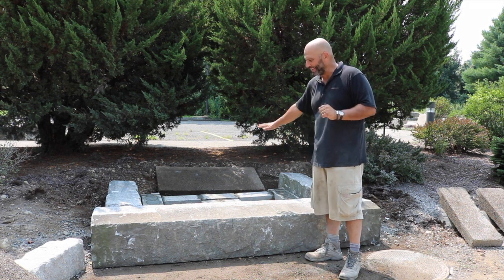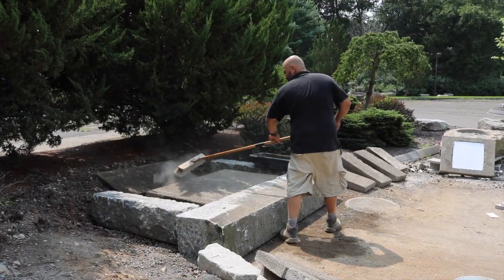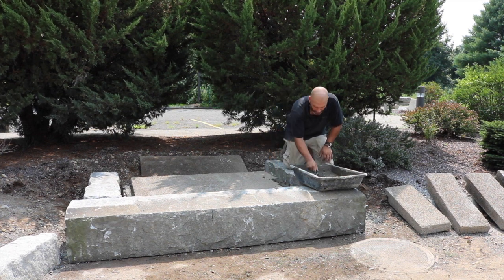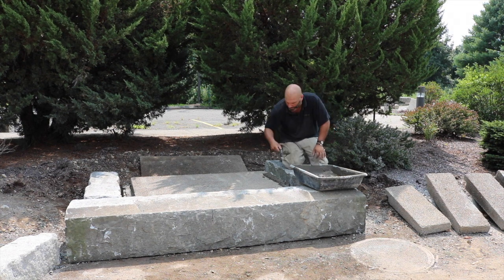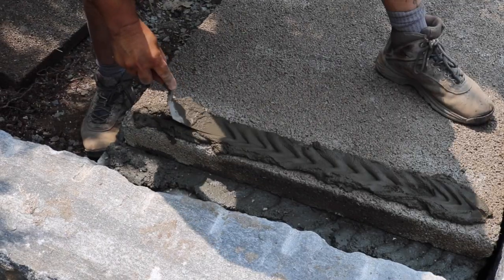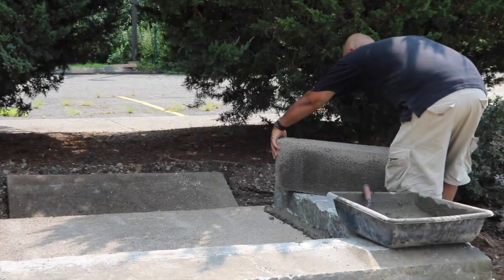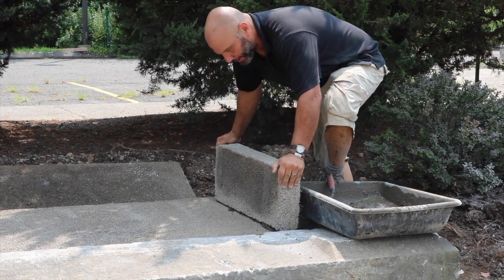First thing I have to do is lay down a mortar bed on the inside of my cinder block so I can lay the base plate of my fireplace. Now that our base plate is in place, we mixed up some Stone Age refractory mortar. Before we set our side walls, we're going to want to set a good healthy bead of that along the edge of both the left and right hand side. In all masonry applications, you only want to apply enough mortar that you can work with in about 10 or 15 minutes. The consistency of the mortar — you should be able to leave your trowel blade in there. I'll get the first section of wall.